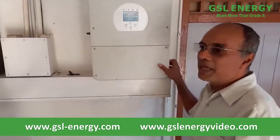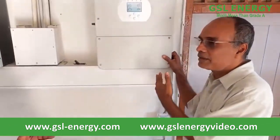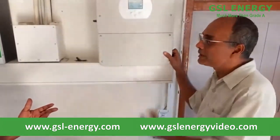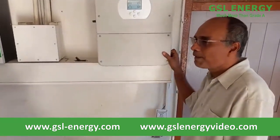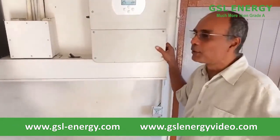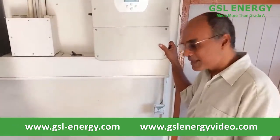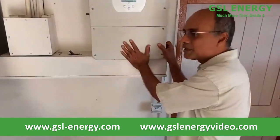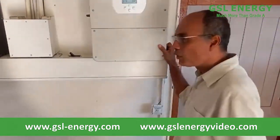So overload means what? If this is 8 kilowatt of power, and if your consumption went to 10 kilowatt, it will trip it out. Oh, you mean like I decide to give my neighbor power? Right. Or you decide to run a big sound system on it or something like that. So you have limitations in how far you can go.